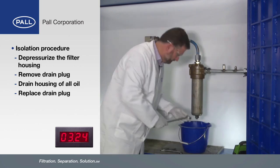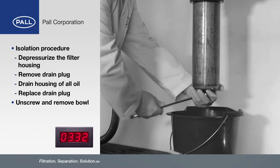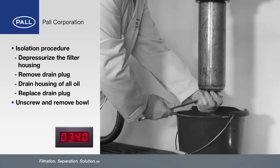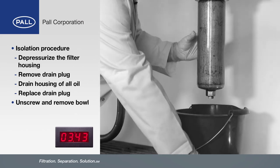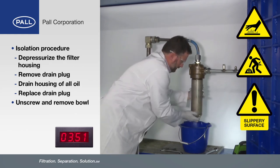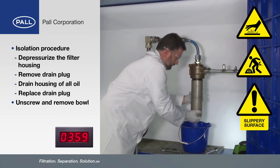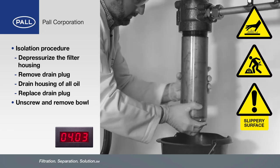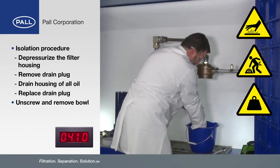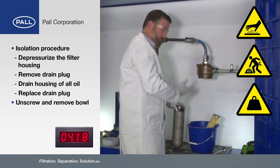Take the appropriate spanner and turn it towards us. A couple of turns and it should get loose enough so we can use our hands. As mentioned earlier, these bowls are heavy and because I've got oil on my hands from draining it, the bowl gets quite slippery, so we've just got to be careful here that we don't injure ourselves. We've lost it a bit there — we've wasted a couple of litres of oil. We need to change the new element now, so that's what we're going to do next.